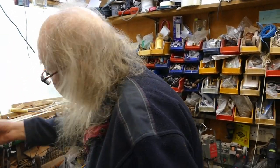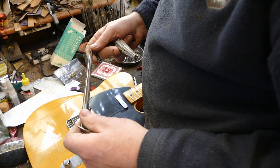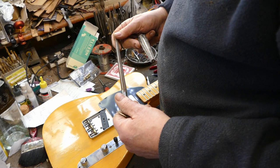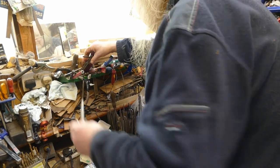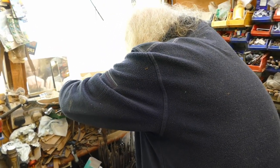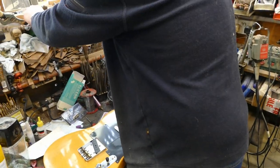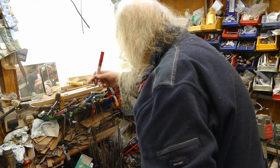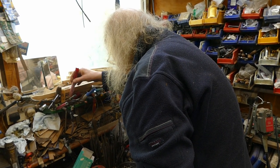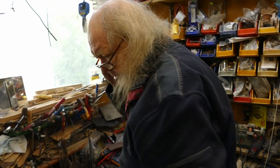I've got reamers. Got a big one for big holes, for reaming out a hole. Do you want your hole reaming out? Get that from Ann Summers. And that's a violin reamer. A reamer, you just put it in and jiggle it. It makes the hole bigger. Just gently. It's got a conical, tapered shape. I've got three reamers. The more you push it in, the bigger the hole. But what if you don't want a tapered hole? Well, that is a problem. You get around that by using a file and filing it to the same size. But you might not file evenly. Well, that's because you're not very good. So give the job to somebody who knows what they're doing.